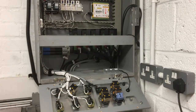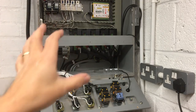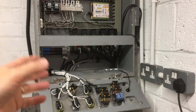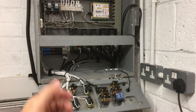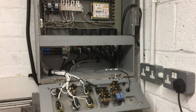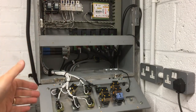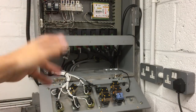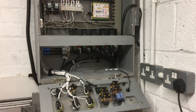Okay, I'm pretty pleased with progress so far. Just taking my time, working my way through, checking it at each stage, obviously catching some little silly mistakes there. Yeah, but that's what it's all about. You just check it as you go through, make sure it's working as per your wiring diagram, and build it up as you go through the system, working through the e-stop system and then the safety relays, and finally we'll get the AXBB unit talking to the stepper drivers.